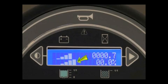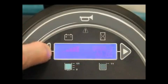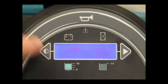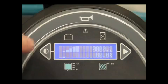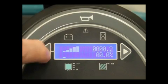The solution tank indicator displays the amount of liquid in the solution tank. Refill the solution tank when there are no longer any bars shown in the display. The recovery tank indicator displays the percentage of liquid in the recovery tank. Empty the recovery tank when the indicator reaches 100%. The display contrast can be easily adjusted. Each time the contrast button is pressed and released, the contrast will darken in the LCD display. Once the display reaches the darkest setting, pressing and releasing the button again will increase the display to the brightest setting.